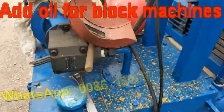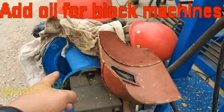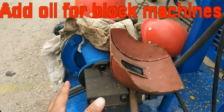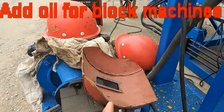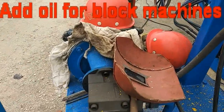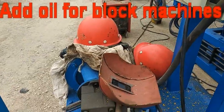Notice the rotation of the motor — this motor. If all connections are correct and the hydraulic station works but the machine does not work, maybe it is because of this motor's rotation direction not being correct.